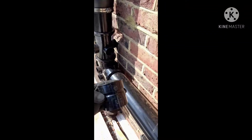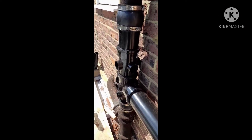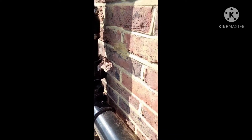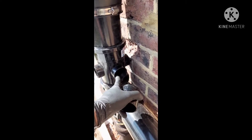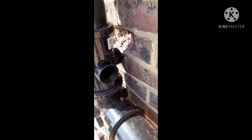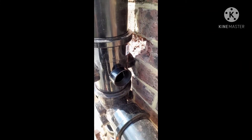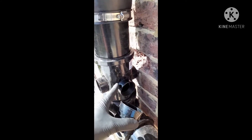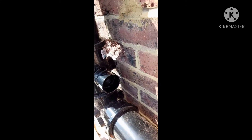After yesterday's work, what we're doing now is connecting a two-inch pipe onto the connector which we put above the soil pipe connection — this bit here. Usually if you want to connect an inch-and-a-half or inch-and-a-quarter pipe, you can connect inside this using the right reducer. But with the two-inch pipe, you have to use a female fitting which goes above this collar.